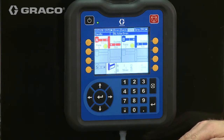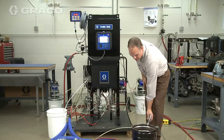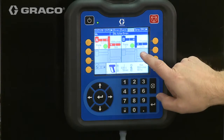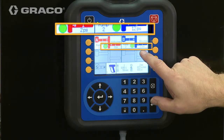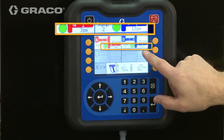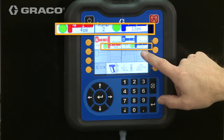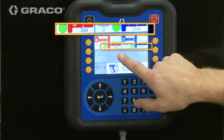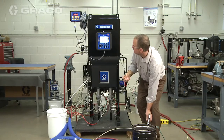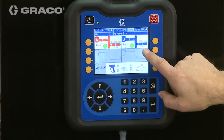The system was able to finish loading the gun. Going back into spray and triggering the gun, we can highlight the pressures from the A pump to the B pump. Because typically the catalyst is a little bit heavier or thicker than the base, we're developing more pressure loss across the pump and the two pressures are not close enough to maintain that 25% relationship. By taking the tolerance out to 90, we can now run and highlight the problem.